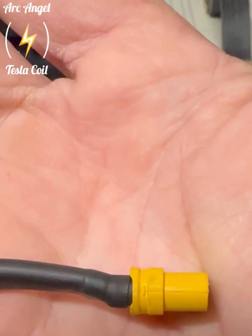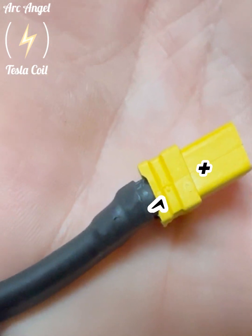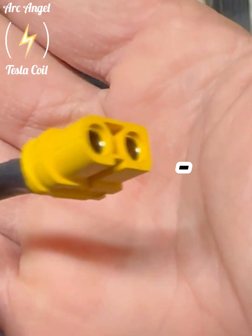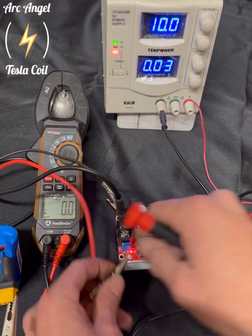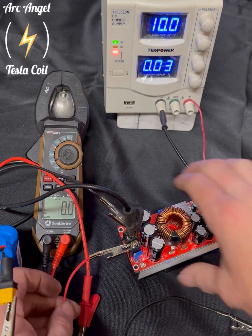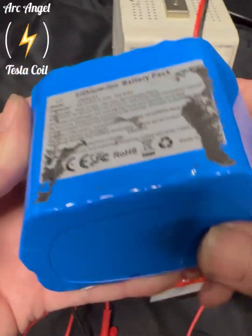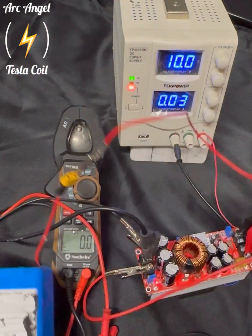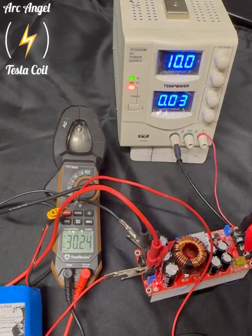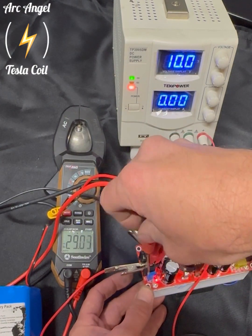Here I'm going to show you how to charge a battery. This is a 25-volt battery. You can see the positive side, which is normally on the flat side of these type of connectors, but this one actually tells you. I'm going to hook this up and show you the voltage and the amperage that you typically want — every battery is a little different. This type of battery can handle a charge voltage of about 29 volts, but I'm just doing a demonstration here to kind of show you how you want to charge it.